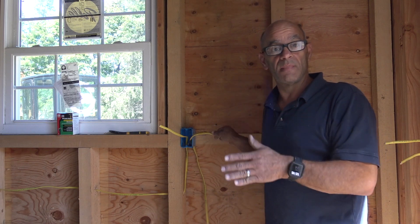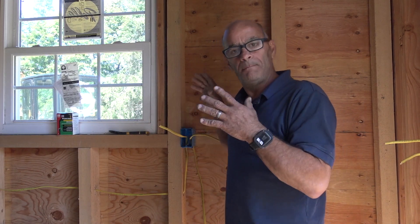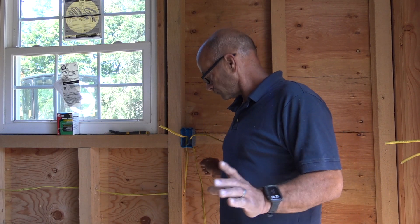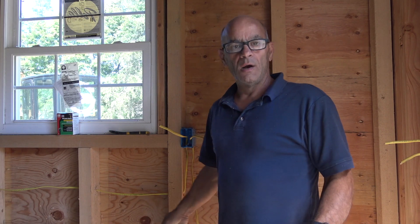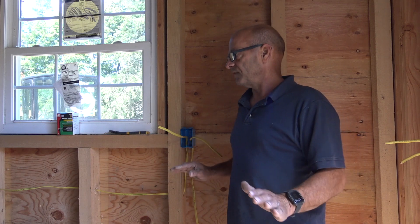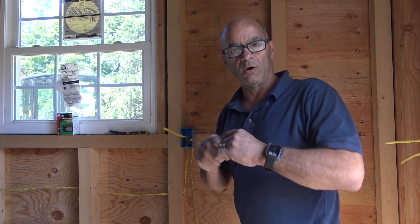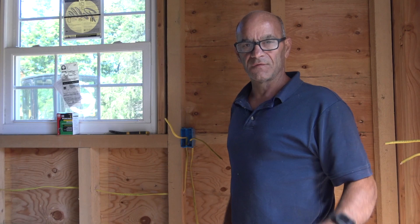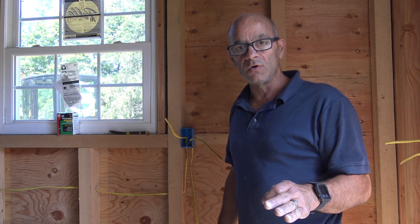This is basic knowledge on kitchen wiring with those codes — it's really important that you keep to those; it'll save you a bunch of grief. These wires aren't stapled in yet. When you go to staple them in, make them look nice and clean and straight. When you drill your holes through the studs, make sure they're pretty much in line. When the electrical inspector comes, always have all your shavings cleaned up. You will also have to strip all these wires, tie all the grounds together, and cap the black hot wire.